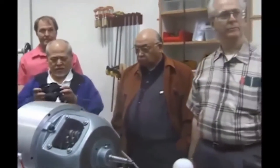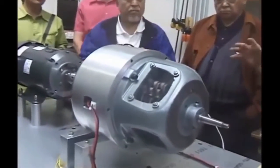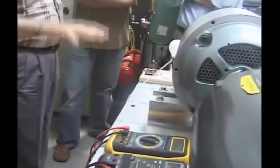So the regulator, what does that do? Well, when we have it, it'll do two things. It'll adjust the fields in here to bring about that effect, but it'll also be linked with the controls for the motor so that the minute it starts to unload, it'll drop the motor consumption. So now the motor will pull practically nothing except cover the loss of it.